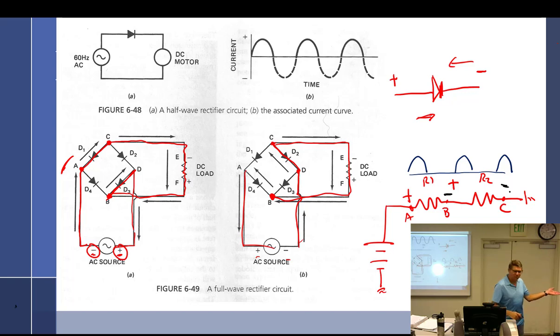So can you see sometimes B is the negative and sometimes B is the positive? So B is negative in respect to A. But B is positive in respect to C. Visual. Black and the red. Correct? Yes. A is positive, B is negative. Right. But over here, B is positive, now C is negative. So this is positive and it's negative. See? Because it's relative. Not an absolute. Right. B is positive in respect to C, but it's negative in respect to A.